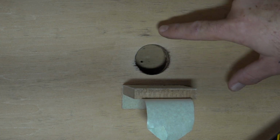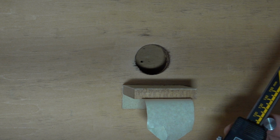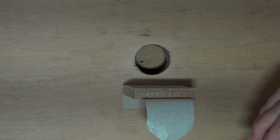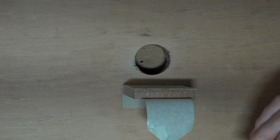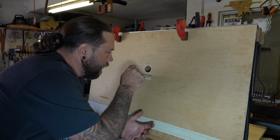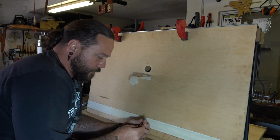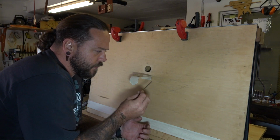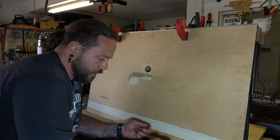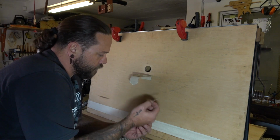From the face on the inside to the face on the outside is about 50 millimeters, so I have to add perhaps another 10-15 millimeters to that. So I need something roughly 65 millimeters long. Okay, as luck would have it, obviously I've misplaced the nail that needs to go in there. Tried a couple of different things, screws. This one is way too thick, and I don't want to cause too much chip out over there. The ones that I have that are thin enough are too short.